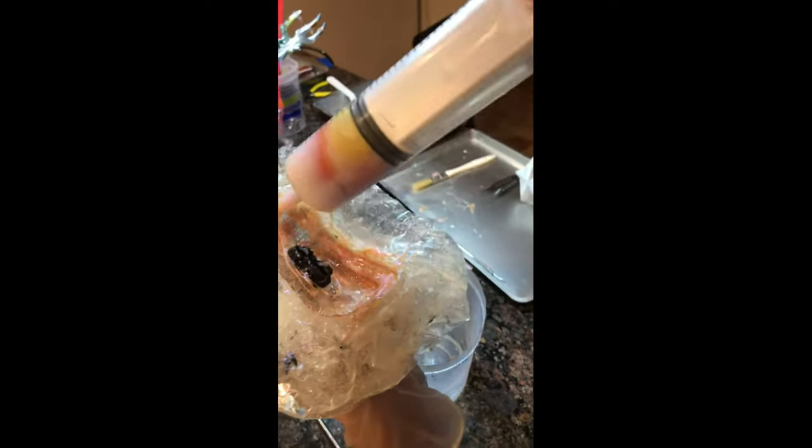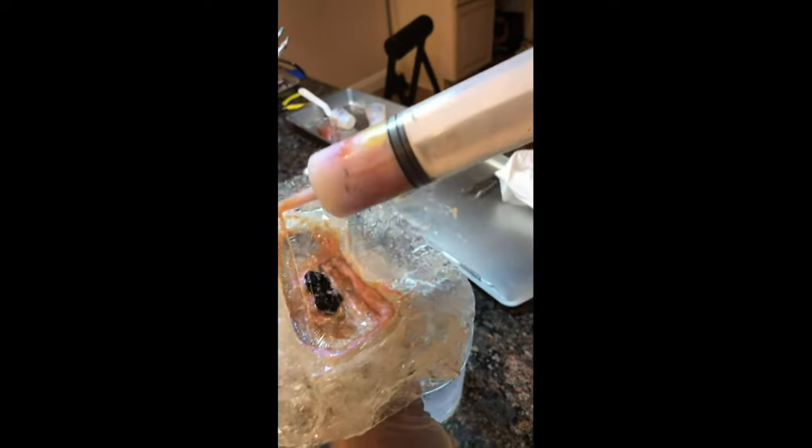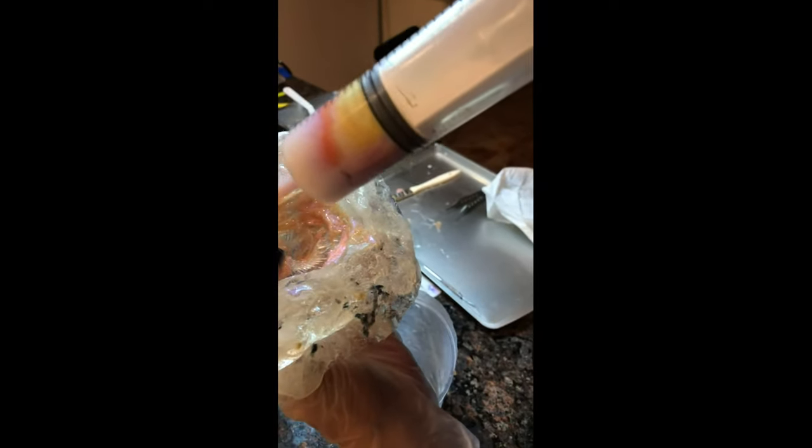Another thing that happens when you do this kind of casting is that you're stretching it, you're pulling the molecules all into the same direction. So even when they freeze and they gel, they've got unidirectional strength because they're all lined up in the same direction together. So you have stiffness just where you want it, and softness, and it's lightweight. So it's a composite technique, really.